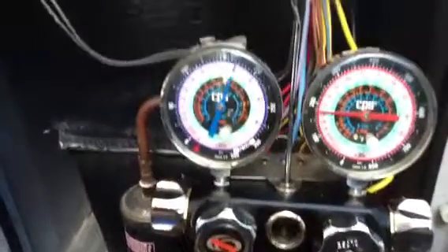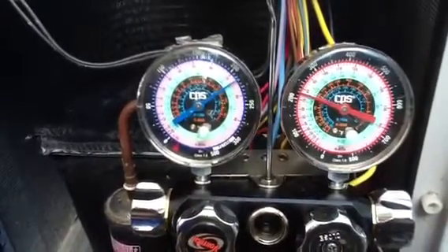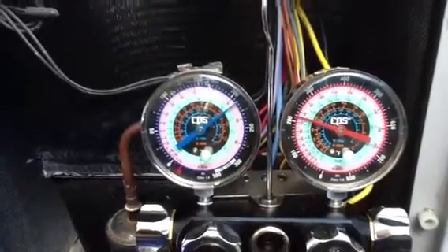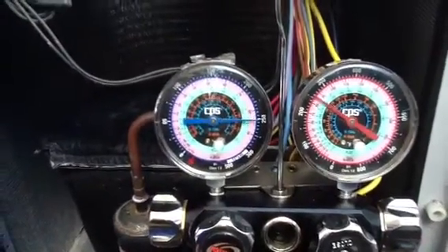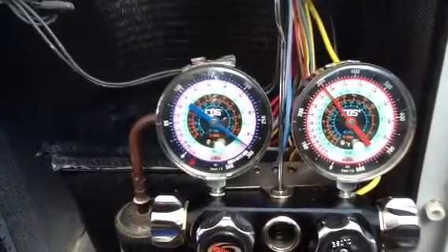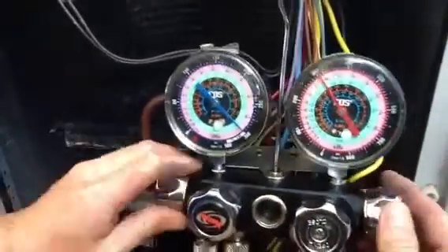So what he's done here, he's actually filled it up now. He's going up to the working side of the pressure of the system, bringing it up to 200. Once he gets to a certain point, he's going to shut it off, and we're going to leave this on for about 10 minutes. He's going to take it up to around 300. If it doesn't leak at 300, it's going to hold forever because this is an R410A system and the working pressure is normally about 325 on the high side.